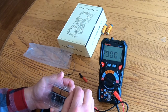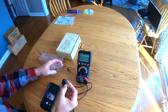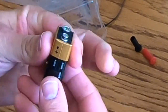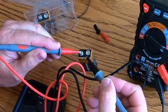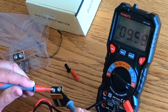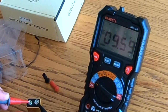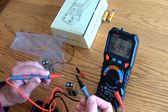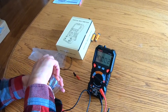Here are some fresh 9-volt batteries that we can go ahead and test — it works much the same way. The small terminal is positive and the other is negative. Touch positive metal to metal, negative metal to metal, and that reads 9.59 volts. That is over the 9 volts it's rated at, so that battery is fresh and ready to go — super handy to find out which batteries are good and which ones aren't.